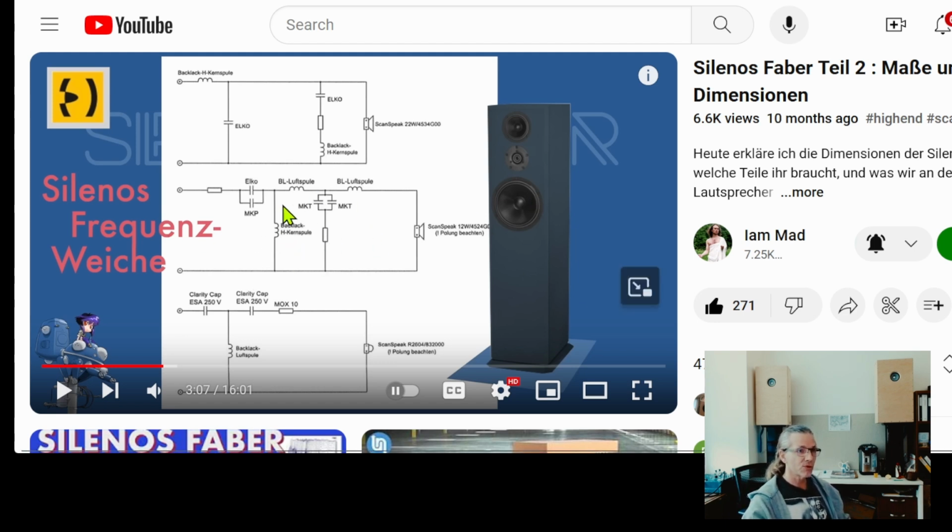because you do not have the exact same impedance alignment, notch filtering, asymmetric slopes. All of these have to be accounted for by using different drivers than what these compensations are using with these drivers.